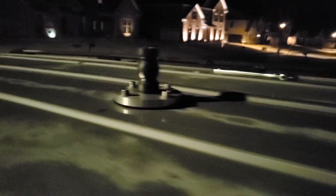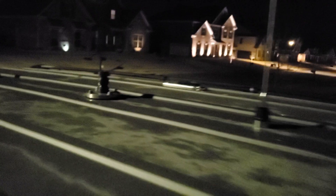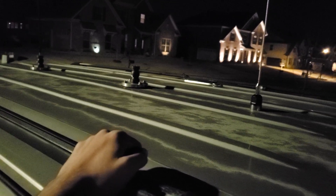This mount over here, which is a 3/8 threaded rod puck mount with a ball swivel joint — that thing has given me 1 to 3 SWR on this forever. And even when I did get it tuned down properly, I had to take the steel whip off the top of the antenna to get that to work.